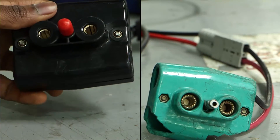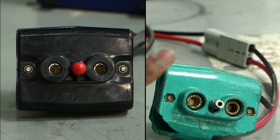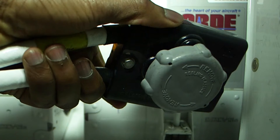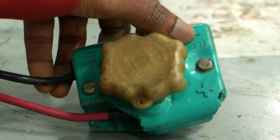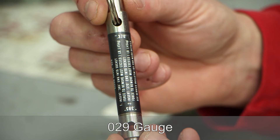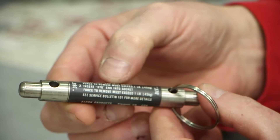There are two different aircraft battery connectors used by the Hawker 125 series aircraft, and each connector has its own method of using the gauge for checking its contact retention. The Rebling Plastics connector is found in most later model Hawkers today. It is black with a gray handle and its tool is listed as part number Gauge 29. The Elcon brand connector is light blue in color and checked with the Elcon Gauge 029 — we list this tool by part number 029 Gauge. Either tool will accomplish the checks required for each connector. I will be using the Elcon brand tool today.